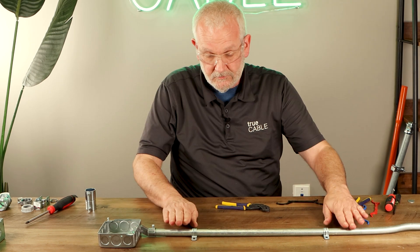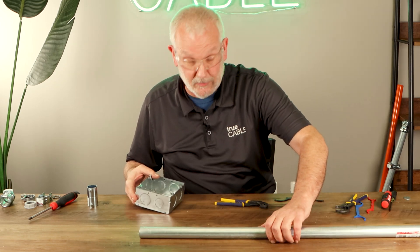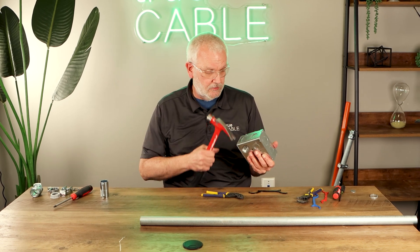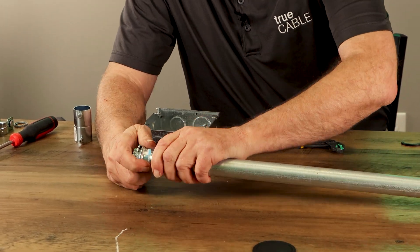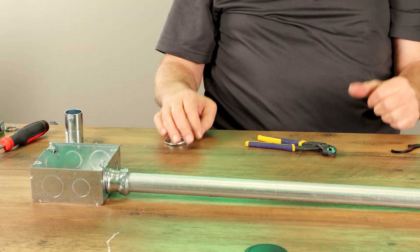You can now use regular wall-mount straps to hold this to the wall and still make it into the box. Now we're going to look at one-inch pipe, which is what we normally use in commercial applications. If you're using one-inch pipe — noticeably bigger than the half-inch we were using a while ago — you need to make sure you buy a box that has one-inch knockouts. Knock out that big one-inch knockout, slide the connector all the way on, and tighten it down. It may feel tight, but make sure it's tight because we're making a ground. Now it fits the box, but we still have the offset problem.